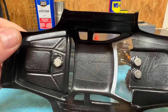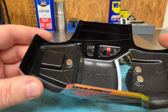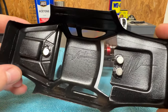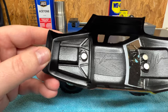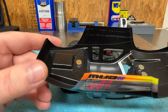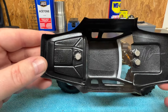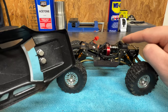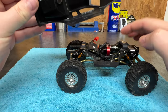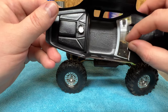That's what we ended up with — we're right there at the window, we didn't go into it. The back, you can see it's got a nice bead all the way around it. It's not going to be perfect — this stuff is very thick and it's heavy, so it moves around. That's why we sit it upside down, so you can see how it's got that nice footprint. Those even connect in the front. The more surface area that glue is touching, the better. When you squeeze that body down the first time and turn it upside down immediately, it lets that glue flow down to the corners of those magnets giving you a good footprint. I flip-flop the polarity on the magnets — when you push across, this magnet fights that magnet when it gets to it, and you saw how it just kind of popped up on its own.